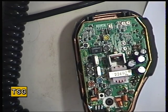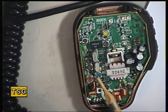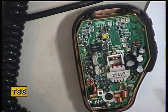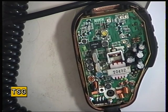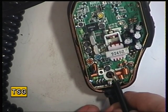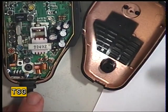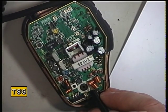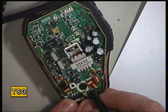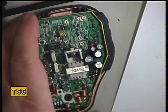That's optimised - not as good as some of those older sets. The main one for sensitivity is the blue one there. I've gone through all these meticulously several times, and you saw me - well you didn't see me do the detector because the thing was off camera. Just as a side note: this coil here, one of the turns was flattened against the case as it was assembled. The stud which holds it all together with the single screw had put that against the printed circuit board, crushing it. That's why this radio was doing 3 watts and not 4 watts when it came out of the box - and this is brand new. That was crushed against there - something to be aware of, robbing the owner of a watt.